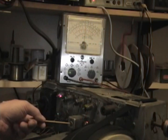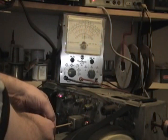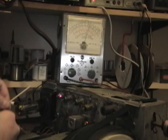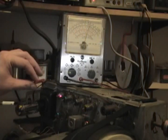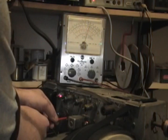First up is A5, which is the top slug in this can — we want a maximum. Going a long way past it... and about there. Now A6 requires a different tool. The internal slug uses the slotted plastic tool, but this other slug is extended out with a brass shaft, so for that I need a tool that has a slotted end with a tube around it to fit over the top of that shaft. And there we go.